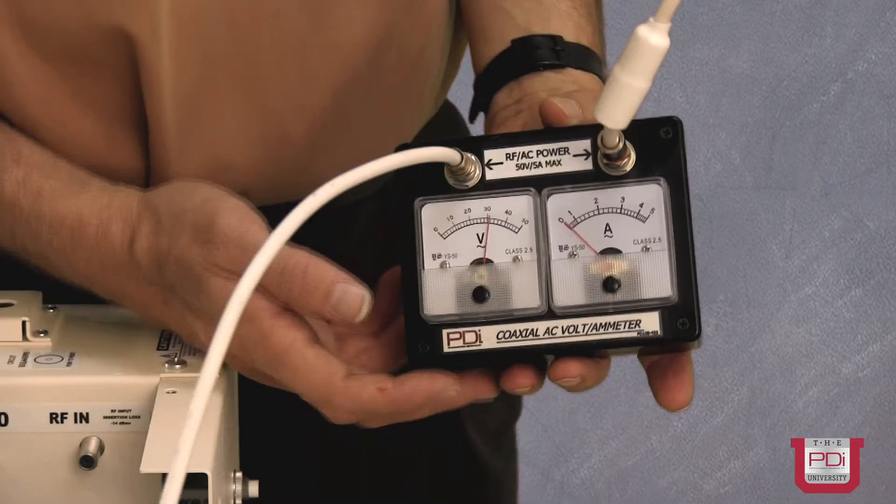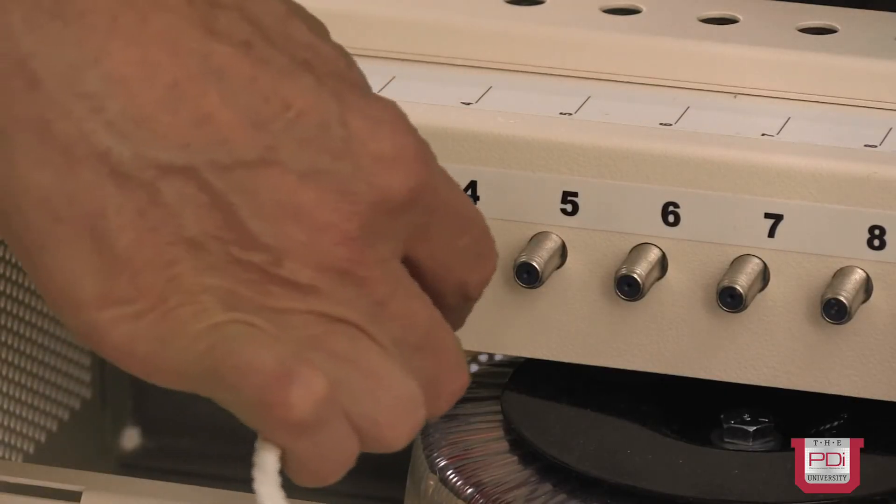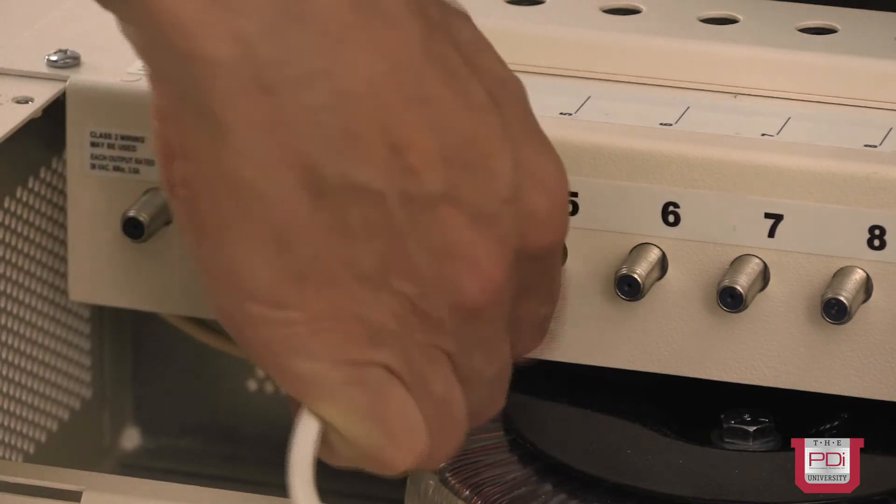What I'd like to demonstrate now is I'm going to connect up the central with both styles of coax. We'll insert an inline voltage and current meter, and we'll see the actual voltage drop that is developed and the differences between both styles. What I have now is an inline volt amp meter. This meter will actually indicate the voltage and current at the TV. I'm going to connect it to one of the active outputs here on our central, and right away we'll notice the no-load voltage and current.